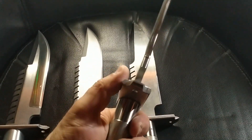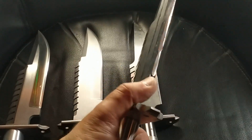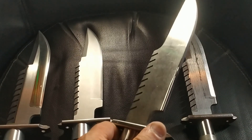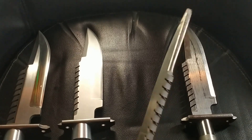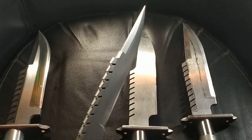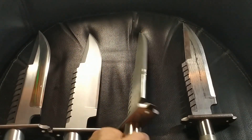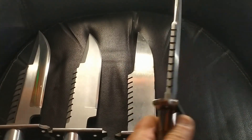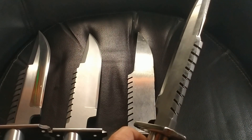Net weight of this... So you see how I've rounded that edge — that little bevel there? Screen-used knives seem to have that, so I've decided I'll add that in. It's got to be done before you start beveling, which is a bit weird. And there is also a bit of a radius on the top of the clip. But that would be better suited where the clip grind doesn't come all the way back. So here, that's square and square. With these ones, when I do get an edge on it, it'll be radiused there. You lose the radius at the top but you kind of just get it just at the base of the tooth on that one.